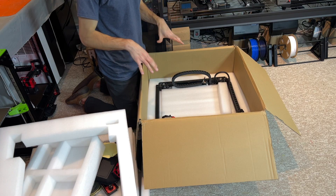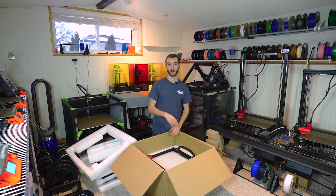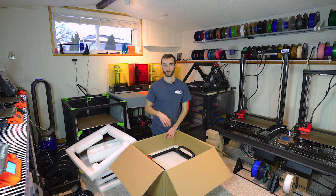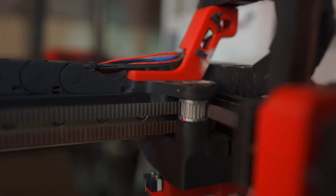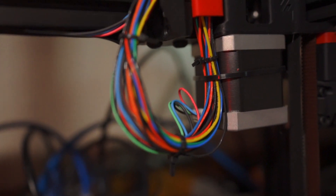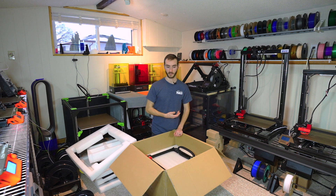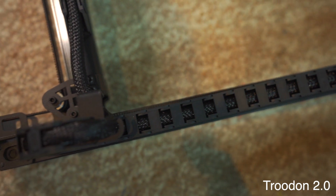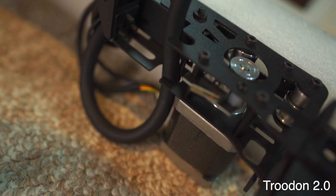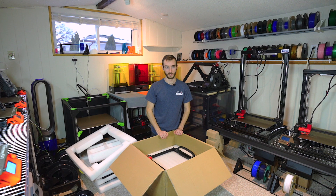Under the next layer of foam, we can see the entire XY gantry. When I built my Voron kit, I have wires that are individually run through the cable chain, and I've already had some issues where they're wearing through because the chain is constantly flexing. So by encasing the cables inside a textile sleeve, that will make them a lot more resilient to wear, and the overall longevity of the printer will be enhanced.